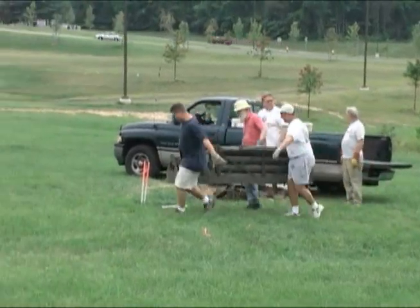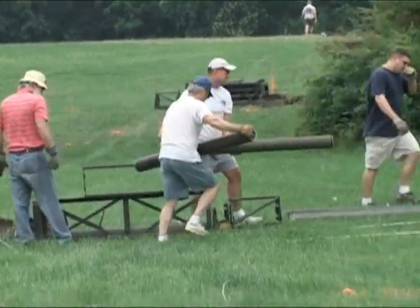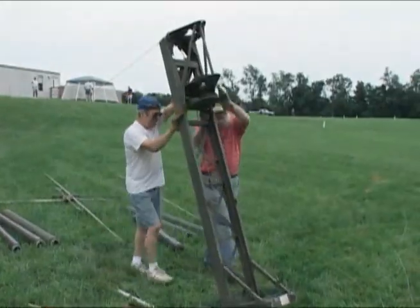Towers are 50 feet high. They have five-foot metal sections. You put in a section and you crank it up, hold it with a brake, put in another section, and crank the next one up. It's quite a process.